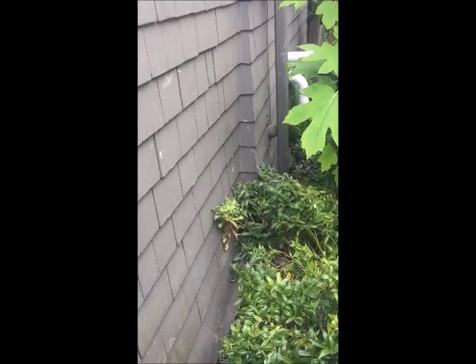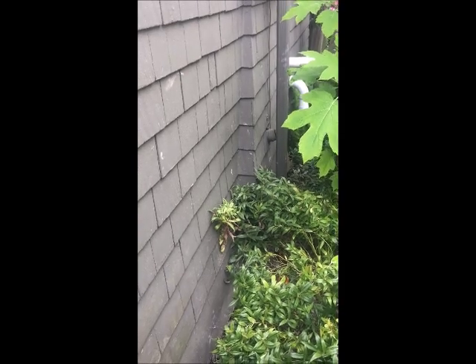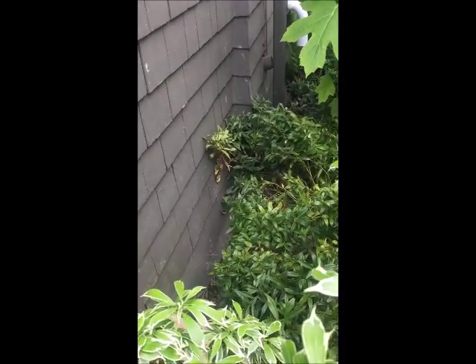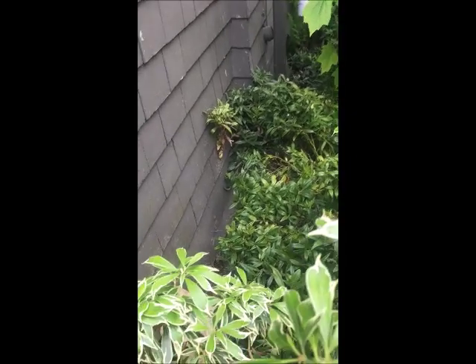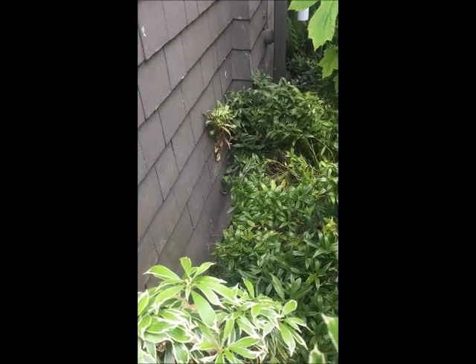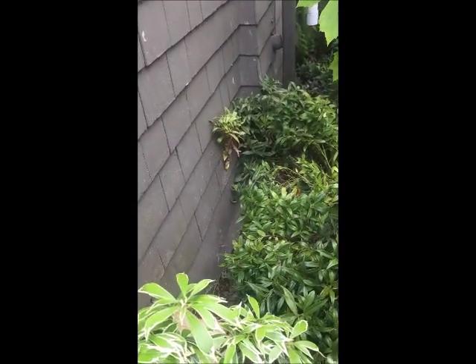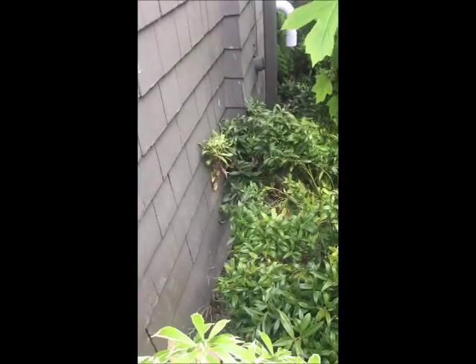There should be a corner foundation for that room down there. I would get a drain system on the outside, down below slab level in there — try and wrap the corner a little bit. If we did, hopefully we can slightly tunnel up under this porch.